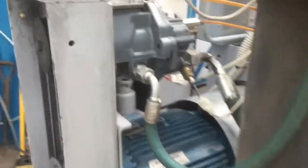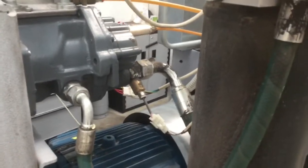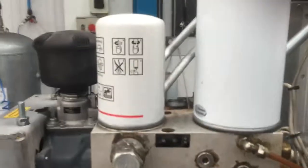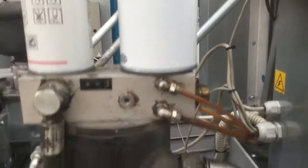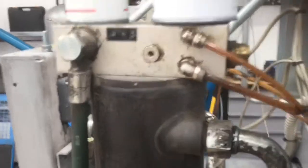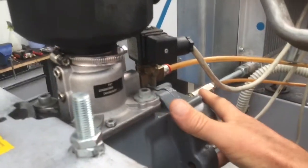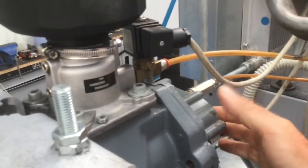We have a small probe here that gives a reading of the running temperature on the main control panel situated here. Oil feed — the separator removes the oil from the air before it goes into your circuit, via this tube here that goes round into a restrictor valve, and the oil is injected back into the main pump to lubricate it.